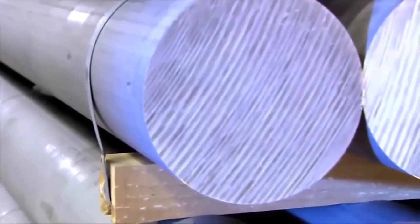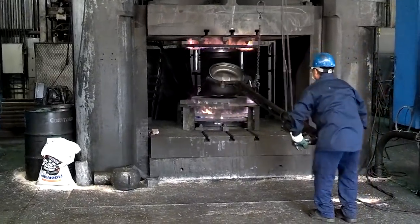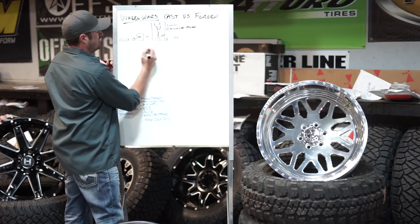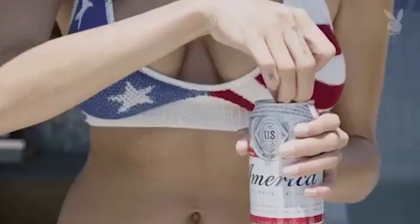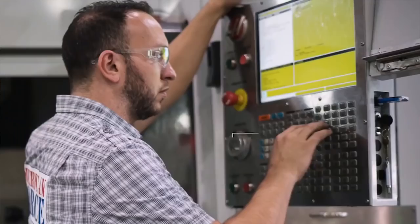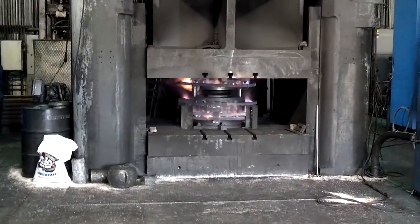Here's how a forged wheel is made. They take a log of aluminum, cut off a chunk, and the whole thing is one solid piece. It's created and sculpted by hammering with lots of heat and 8.4 million pounds of pressure to push an aluminum puck into the shape and size of the wheel, with a lot of CNC machining. Because of all that pressure compressing the wheel and creating a much denser material, the quality and strength is going to be a lot higher than your cast wheels.